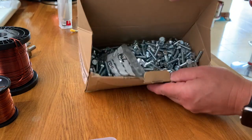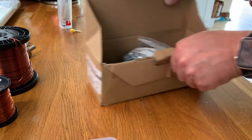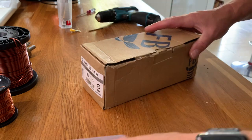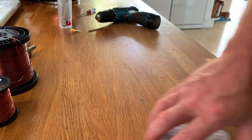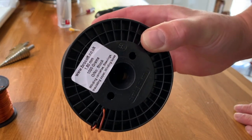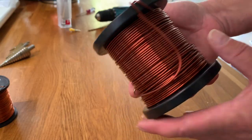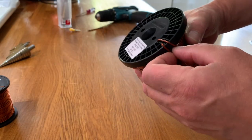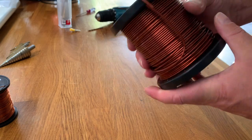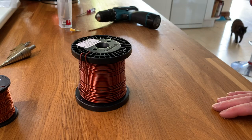I had a delivery today - just one or two bolts, M6 and some M6 nuts. And also some wire from Bro Cop — I shall put a link in the description. This is 1.8-millimeter copper, enamel coated, which we use to make our coil, our base loading coil today. So that's what the job is: make a base loading coil so that we can put 80 meters on our 40-meter element.